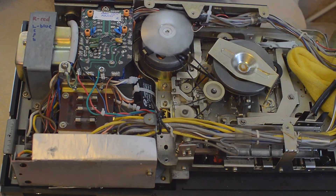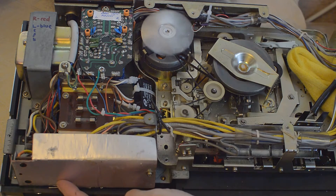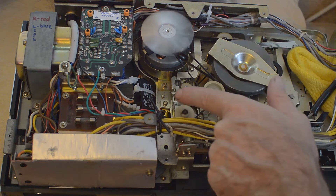I recapped this side with all new electrolytic capacitors and most polyester capacitors replaced, and cleaned the circuit board completely. I also did a complete transistor replacement, mainly replacing the transistors with C1845 series and C1850 series NPN transistors, and that includes the Dolby circuit as well, plus a new motor run capacitor.